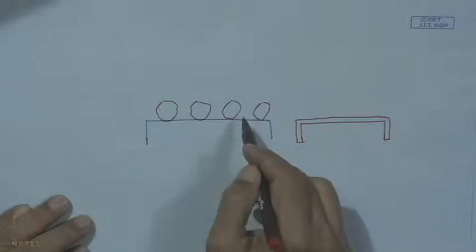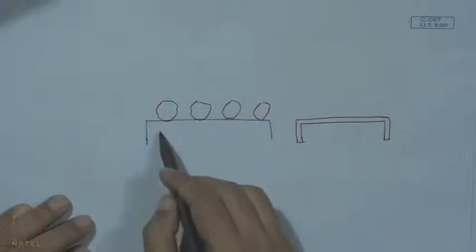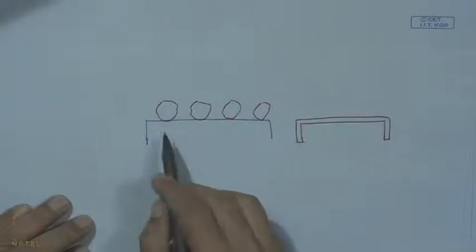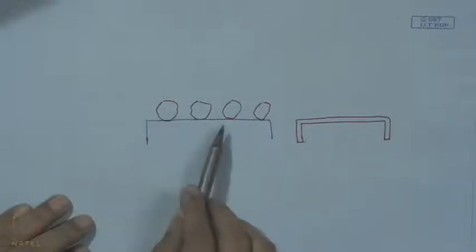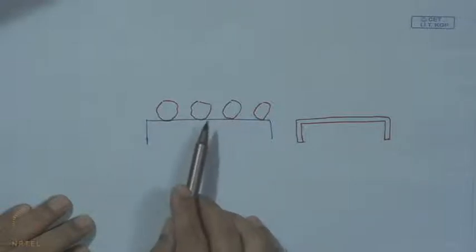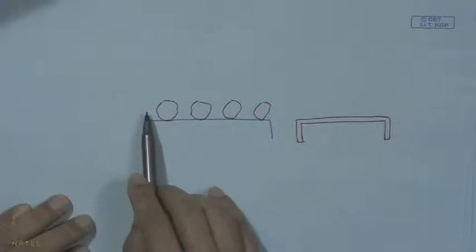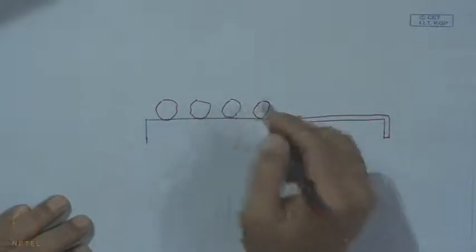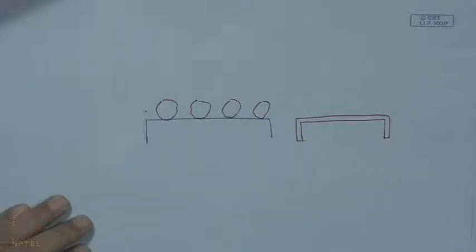But when we set one layer of grit, the whole performance of the wheel depends upon the retention of that one layer on the surface. We must have some kind of bonding agent and also a technique of bonding. This is the substrate — the basic material — and there we have the bonding agent, which can be done in various ways.